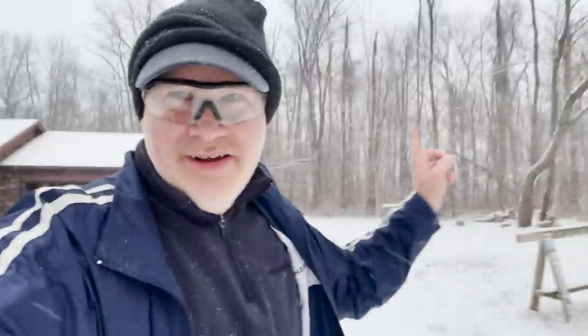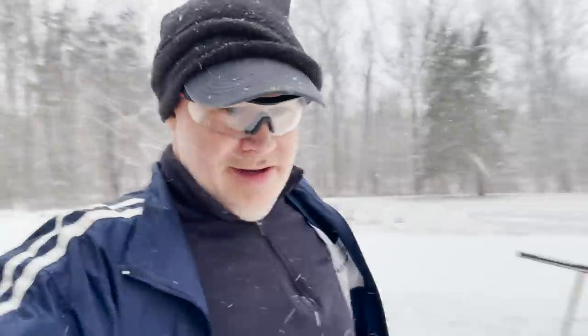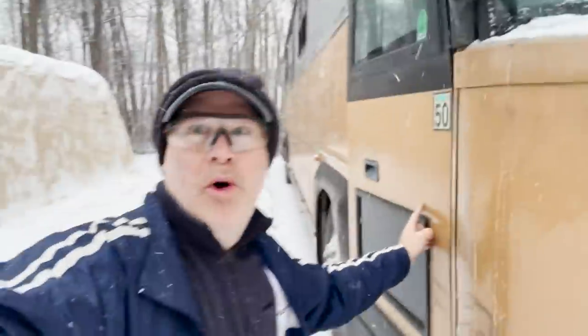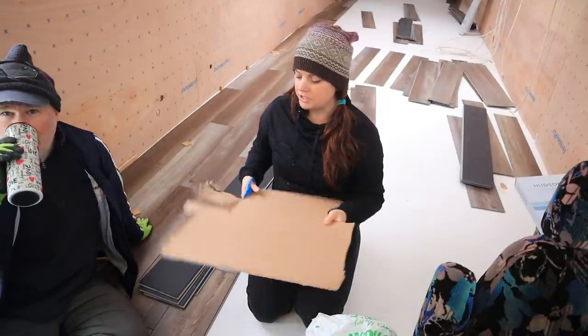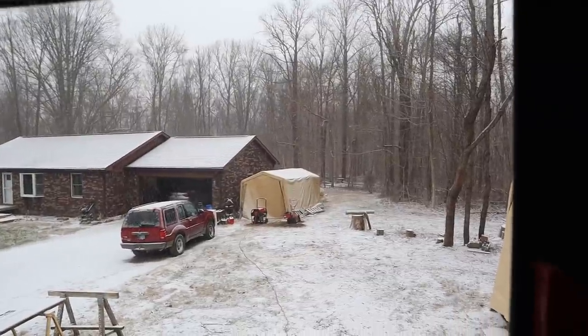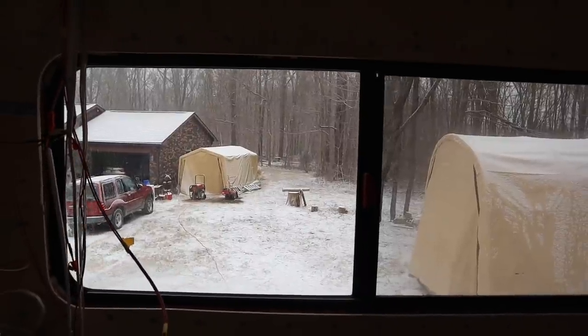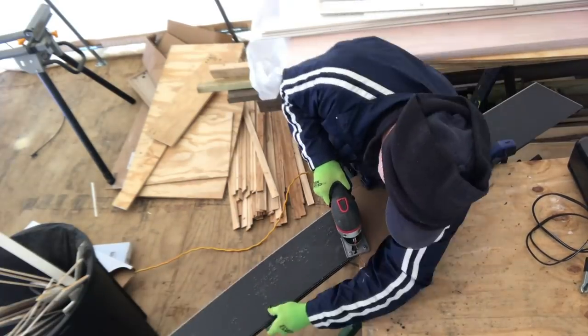It's a little snowy out. At times like these I'm really glad we got our winter workshop over here. It's just walking back and forth — it's snowing, it's cold. So we can just go right from the bus into there to cut some of these planks down. The very front of our floor, the first step up into the living area, is at an angle. We're using the cardboard box that our planks came in to make a template for that angle. We got them cut — let's take them in and see if it worked.